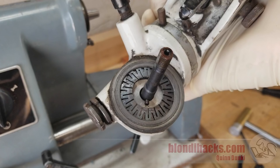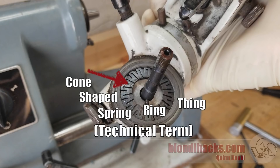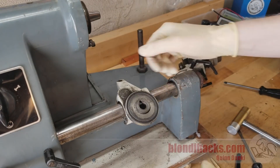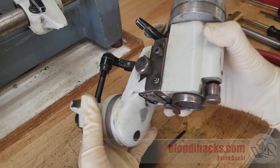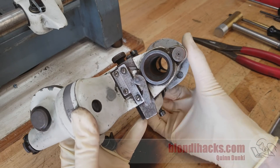Here's a preview of the first of many really cool parts in this machine — there's a cone-shaped spring ring thing in here that's applying tension to that swivel, and that's a really cool part that will give us a little adventure in an upcoming video. Now we can also get a look at the base. A quick sidebar on this workhead: if you're wondering why it looks like a 1960s spacesuit, it's because it's doing a very similar job — allowing you to position something in three-dimensional space within a given work envelope using only very simple joints. It's a series of swivels in different dimensions that allow you to very precisely position the tool you're grinding in 3D space relative to the grinding wheel.